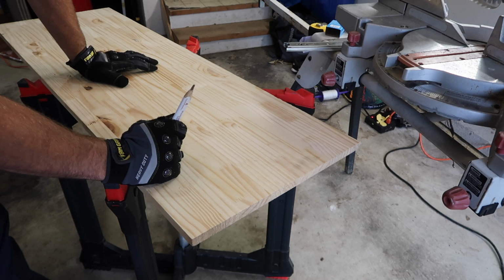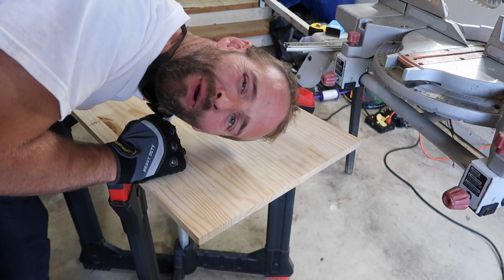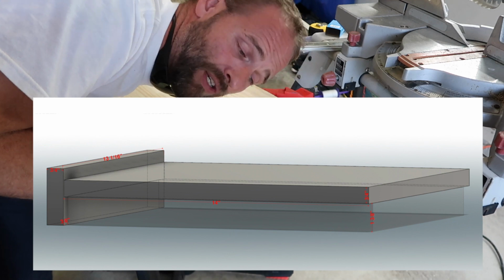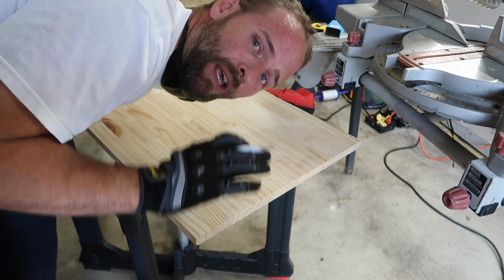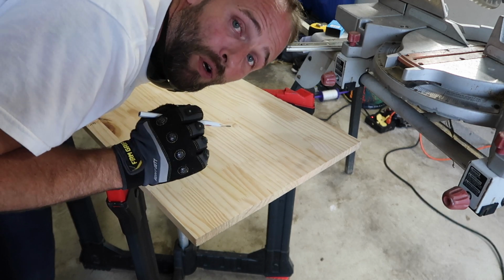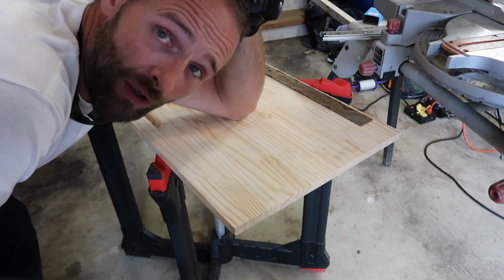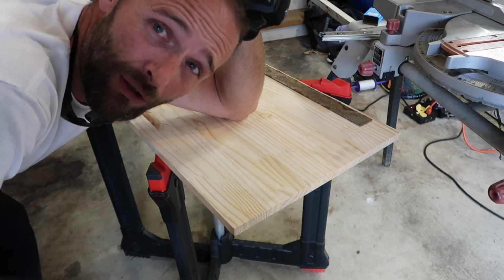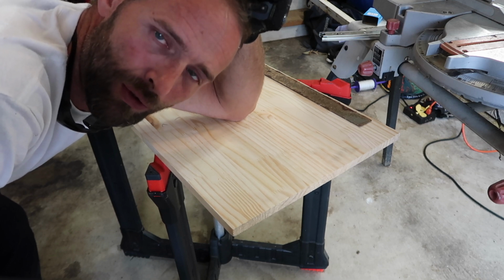So now we're gonna lay out the surface for the drawer. That's gonna measure 13x14 inches on the 1x16 material. Again, that's 3/4 inch thick, the 1x16 material. We're gonna cut that down to 13x14, and that's for the Kallax unit from IKEA. 13x14 for IKEA's Kallax, and 13¼x13⅝ are the measurements for the Target threshold unit.